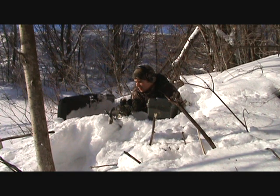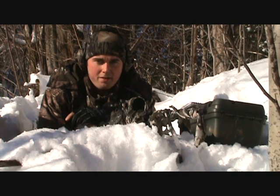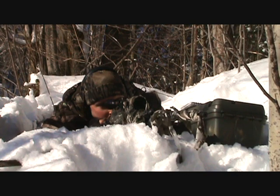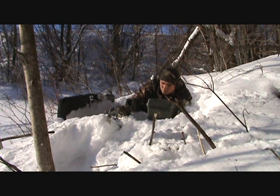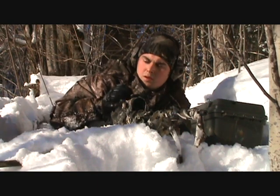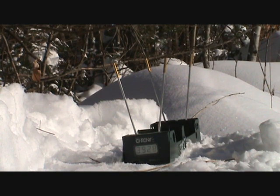The primer still has radiused edges and there's no ejector marking or anything whatsoever on the head. That's five shots - it's going to take a little bit. The barrel's not quite as cool as I'd like it to be, but we're losing light fast and I'd like to use the chronograph while it's here. Reading 26.4 on the scale. Next shot: 3769 feet per second. Primers are still looking good. 3928 feet per second. 4000, 4006 feet per second.